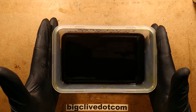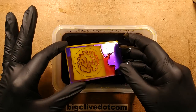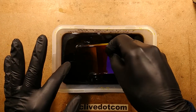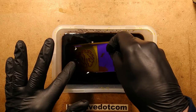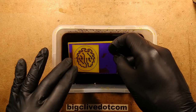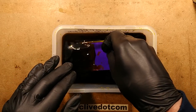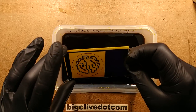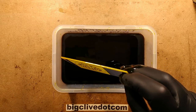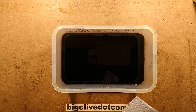It's been etching for a while now and I'm going to lift it out and show a perfect etch — just superb. One thing to watch out for is when it looks like it's finished etching, sometimes there are little traces of copper that just need a tiny bit longer — the same thing as with the developer. But I'm seeing perfect separation between all those pads and the holes in them. I'll give that a wash now and then we shall drill it.